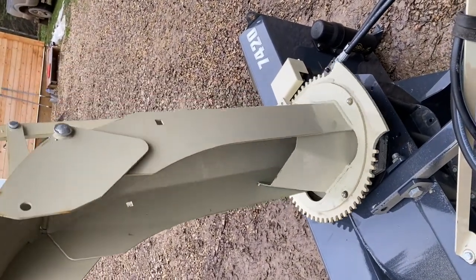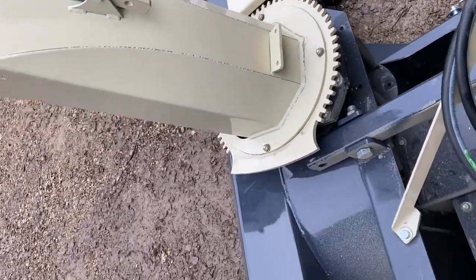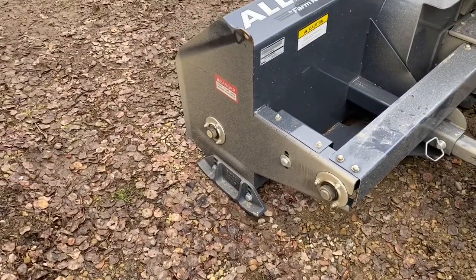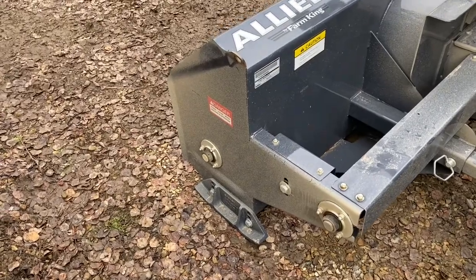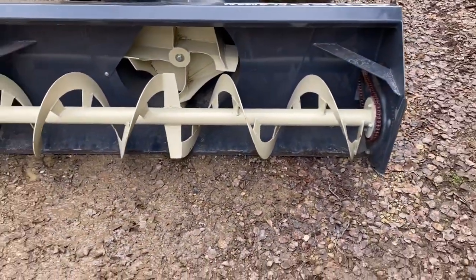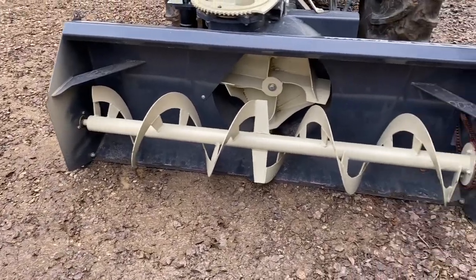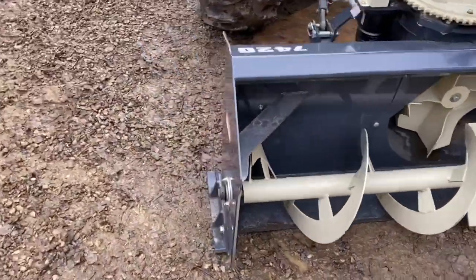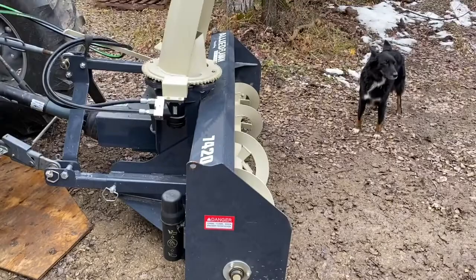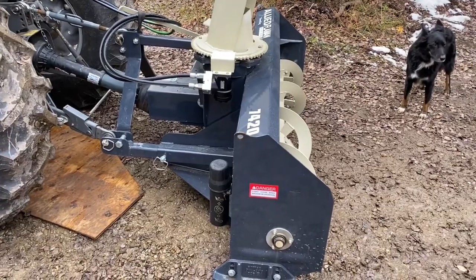That's much better! You can see it's going to need a little bit of grease around that ring gear. What I've also decided to do is drop the skid shoes down a little bit so it brings the snowblower up off the ground - I'd rather have it as a snowblower than a rock thrower. That looks fairly simple - four bolts, drop it down the hole and back up again, and she's ready to go. Just need some snow to try it out. Thanks for watching.